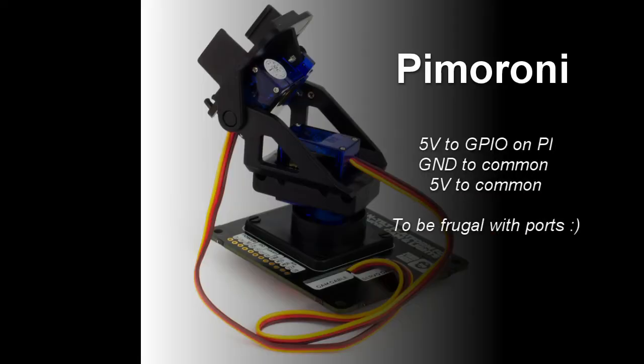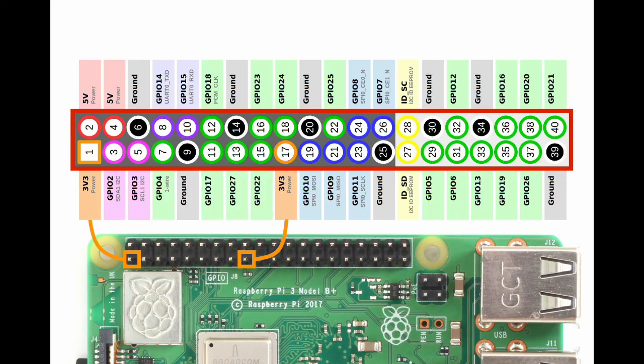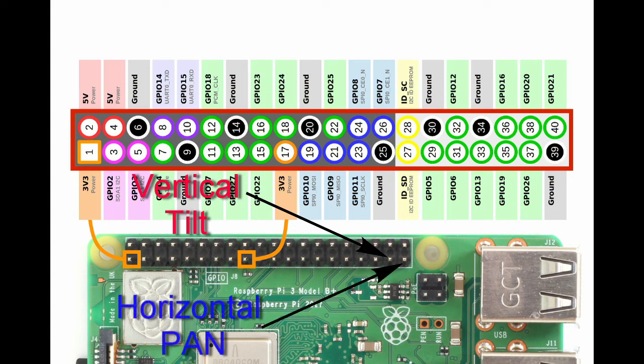For those of you who want to see the setup of the servos on a Raspberry Pi and the code difference between the move-and-kill method and the keep-it-live method approaches, here's a quick rundown. The pan tilt hat I used for the car build was a Pimoroni unit. I created connectors for the 5 volt and ground, then assigned the PWM signal input lines to GPIO ports — port 19 for vertical tilt and port 26 for horizontal pan. With the hat servos attached, I created two versions of code: the keep-it-live version and the move-and-kill version.